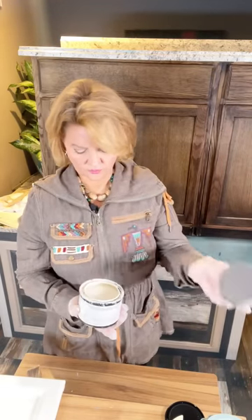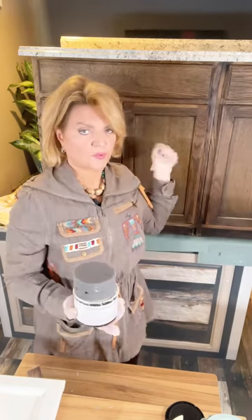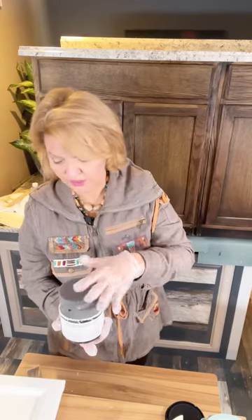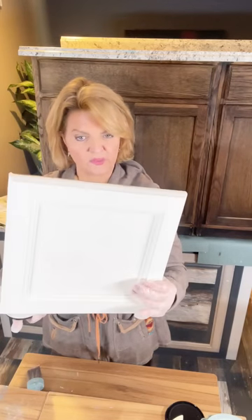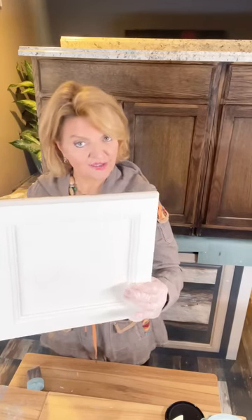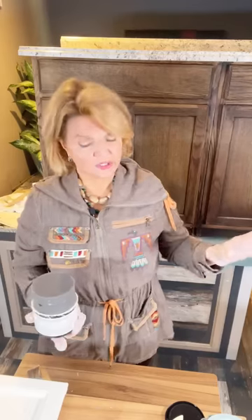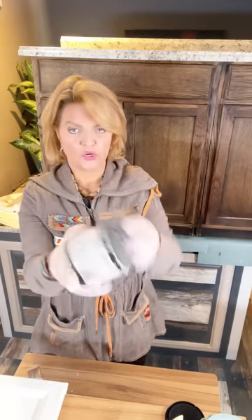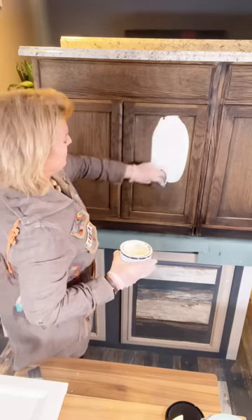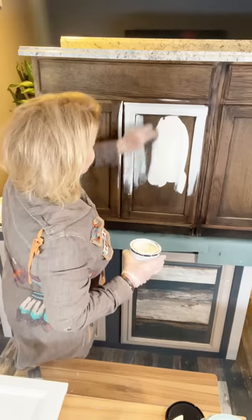A lot of you are asking about wood grain — it's always on the topic list. This is a pretty grainy cabinet, so you'll see why it's relevant. The paint will soften wood grain but it doesn't make it go away. Here's a cabinet door with heavy oak grain — a raised panel door with lots of grain — but you cannot see the grain in this finished cabinet door. If you want it gone, there are grain fillers, but that's a big sanding and messy process — like plastering your cabinets.